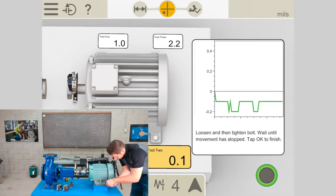I'll turn on the two XT770 measuring units and let them connect to the display. At the bottom I now have two new measuring methods: continuous sweep and multipoint. Sweep is useful if you have a lot of backlash from a gearbox, or a large shaft that's hard to stop. I'll start the sweep method, rotate roughly 90 degrees, press enter to start sweeping, then press the green button again to get results. The numbers are very repeatable with the previous results — very good.